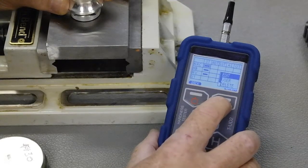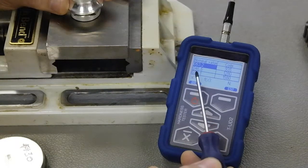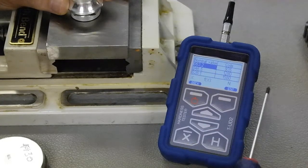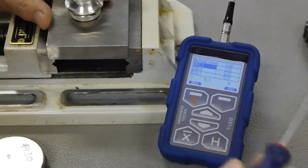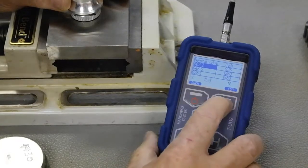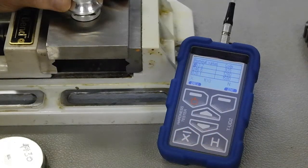I'm going to hit the select key here and I want to edit that. I go to edit and it takes me into the calibration screen. This is the most important side for us because it's telling us what the calibration blocks were in terms of hardness that the device is recognizing. I can see how my display changed from being solid so that just the first character is shown.